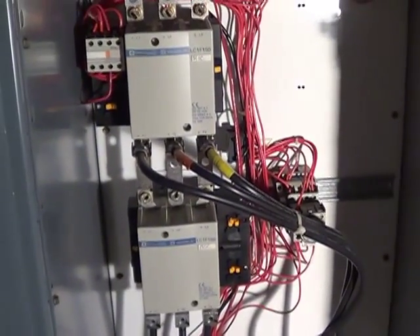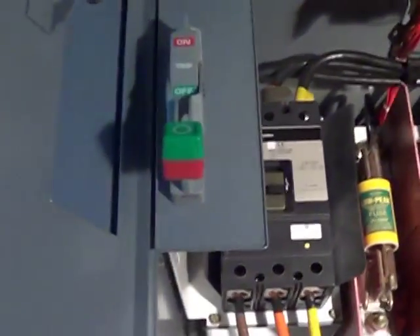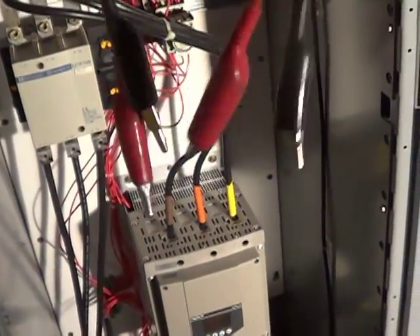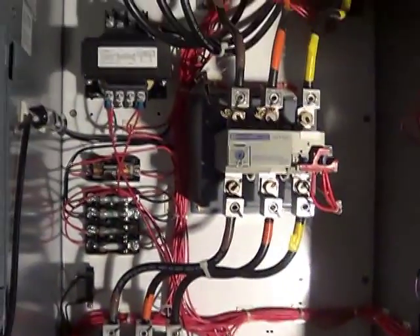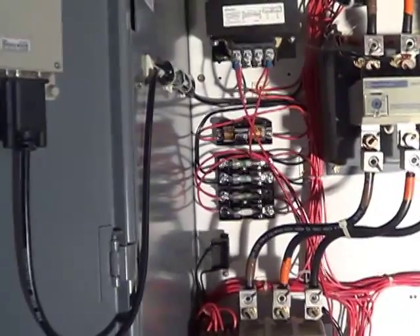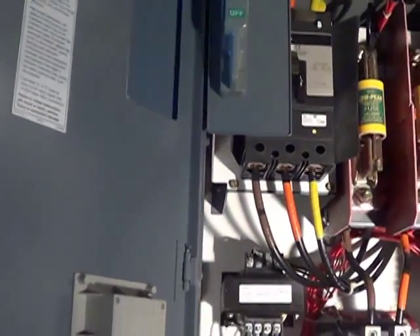Let's give it a shot — see if all the smoke stays in. This might appear like it's unsafe, but I've already gone through this once. I'm glad I'm wearing this rubber rain suit — there's a safety here. I'm pushing down now, the cabinet is energized. I use these jumpers — that's an HVAC mechanic's best friend right there. You're always having to test stuff and bypass safeties and different things. Don't take that wrong — do not think lightly of that. Don't make a habit of doing that unless you absolutely for sure know why you're doing it and what the consequences could be. Think ahead and be safe, but sometimes it's necessary.